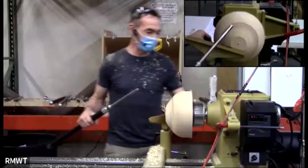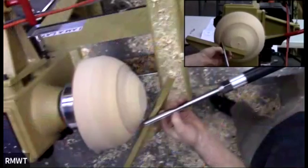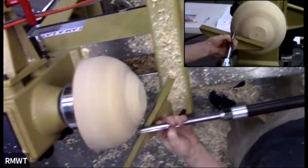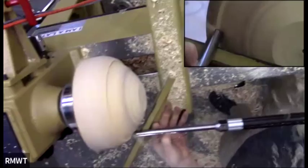So what am I doing when I'm controlling the tool? Well, let me show you what I'm doing as a professional turner, and anybody else that uses this technique. And we all do it in spindle turning: if I start to feel the bounce, I control it by canceling it and letting the gouge sit on top of the surface to cut a new surface. So I can rub on that there, cancel it, cut into it, and keep going. Then I'm creating a new surface. But if I take my fingers away, you'll hear the bounce starts to come back.